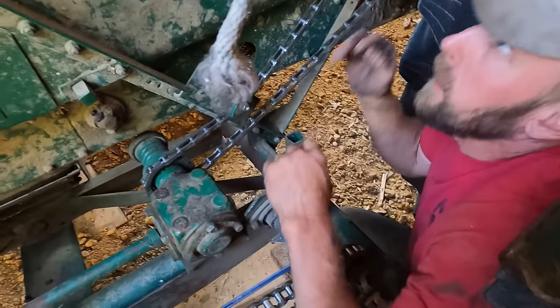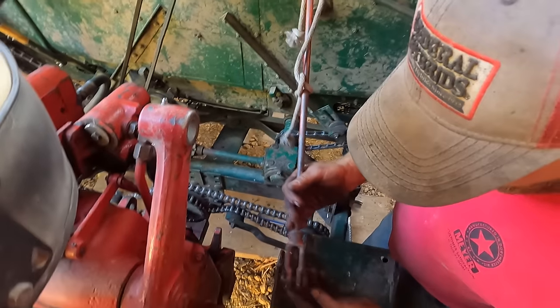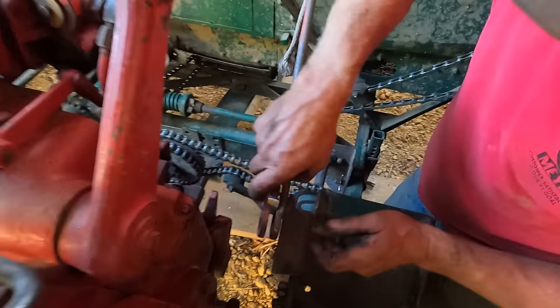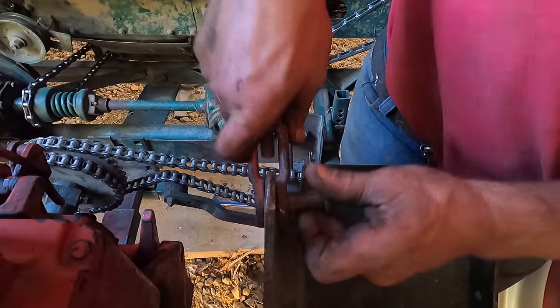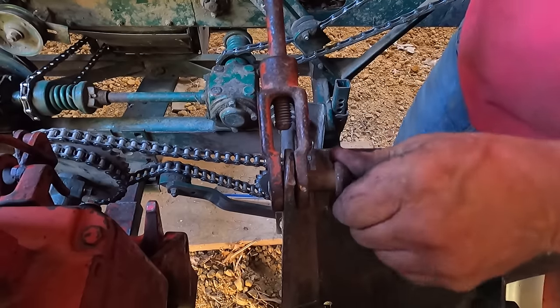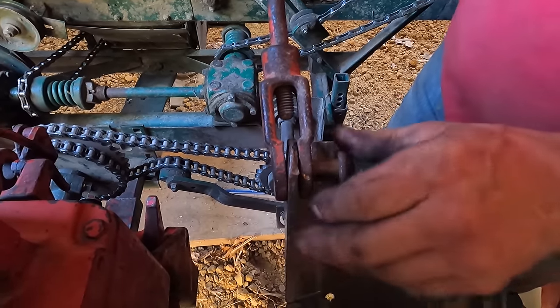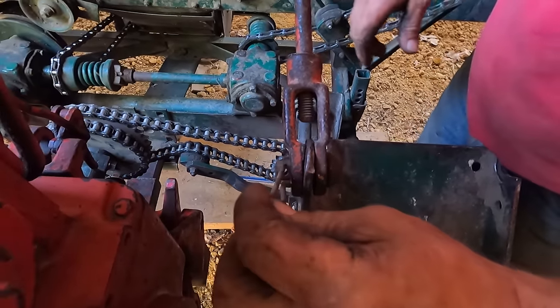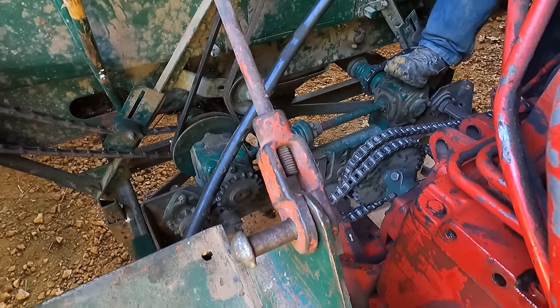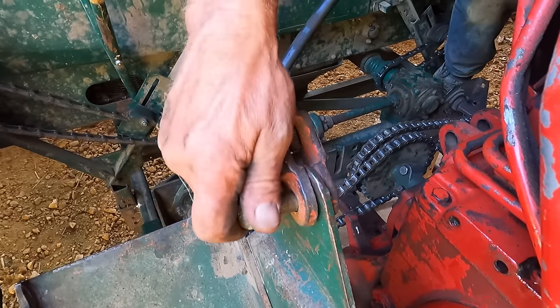So we got that on. Now the cob elevator rods, which are these, which mount again over here. And then there's a bracket back there that holds that cob elevator up, keeps everything steady until you get this mounted. It's just like a simple jack type system. Try to mount it on a sunnier day, so you got plenty of light.